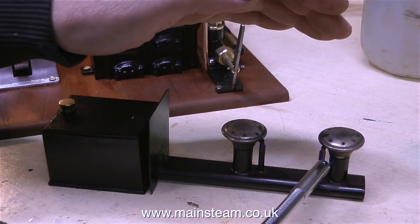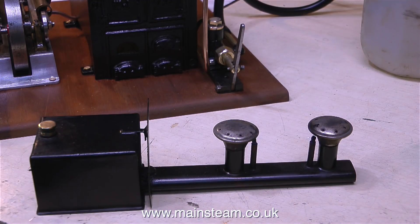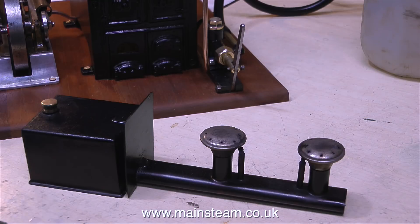This is a vaporising burner — I've covered it before in this series, and it's a great thing. The small wicks heat the top part of the burner, which heats up the methylated spirit in the burner itself, and once the vapour catches fire, the entire burner can be slid underneath the boiler to heat the water.